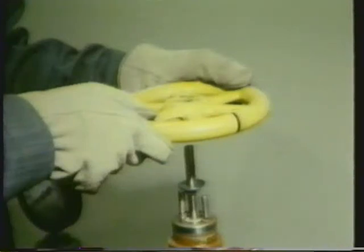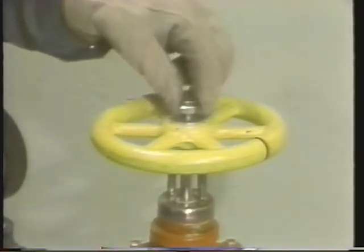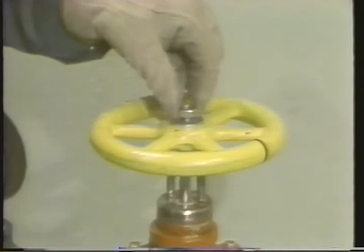The tool is lowered to avoid damaging the stem's threads. A nut and washer are placed above the tool to hold it in place. Your facility may have other types of tools used when lapping, so be sure to check this out with your supervisor.